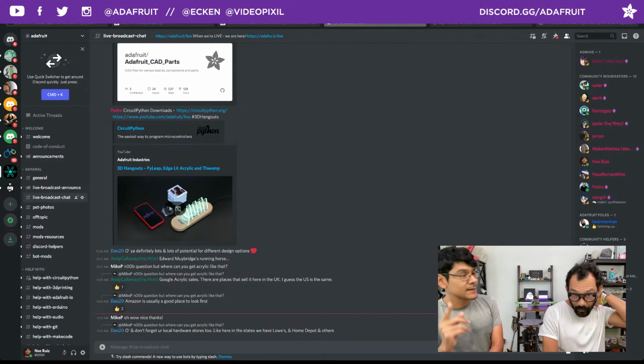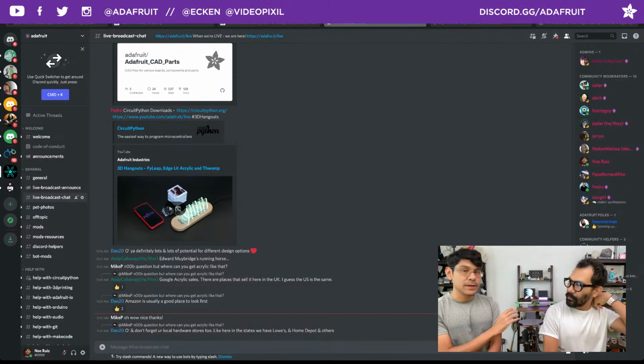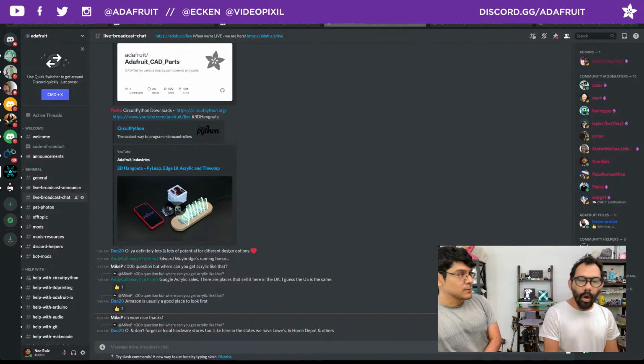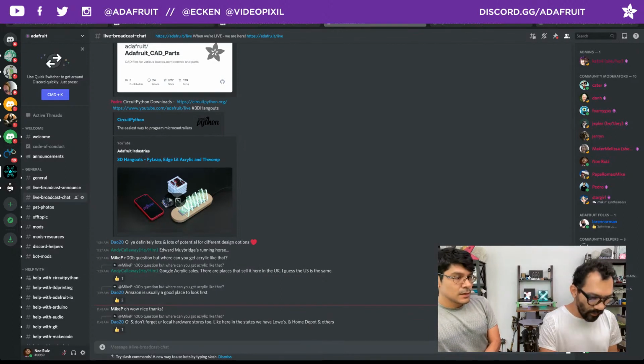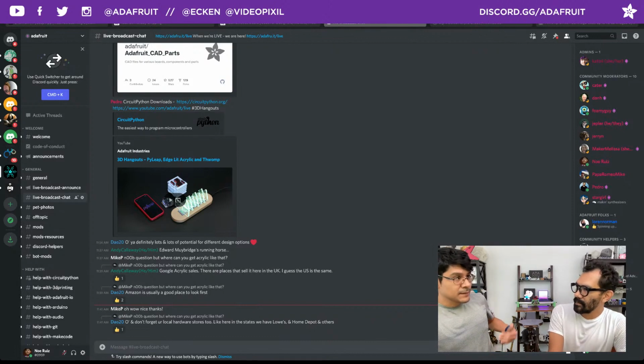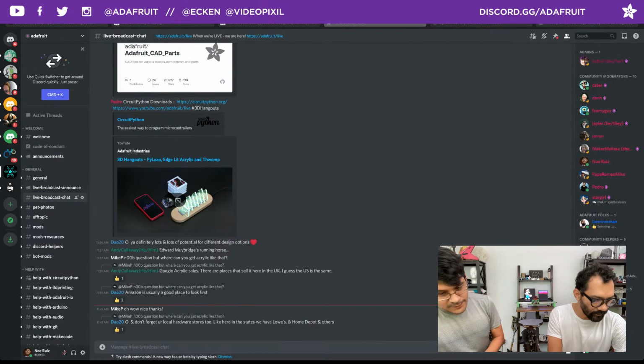Now, be careful of that, because I did that way long ago, and the acrylic I got had UV protection, and it messed up my tool bit. So just be aware that there are some acrylics out there that have a special coating that might not fare well with your end mill. Laser cutting might be different, but with my end mill, I remember messing one up because I got this smoky black acrylic, and it had built-in UV protection. So I guess that's what messed up my tool bit.